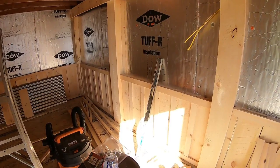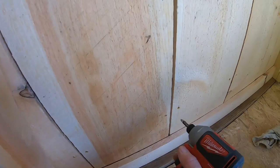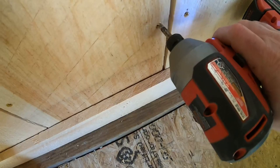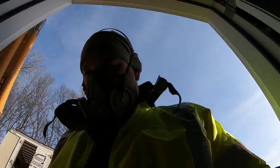Here's a little tip: I screwed these boards on instead of brad nailing them because they were so cupped. You can adjust your screw — say like this one had a gap — just lower your screw a little bit to shut that gap until it touches. That's going to make that look a lot better and your trim board a lot better.